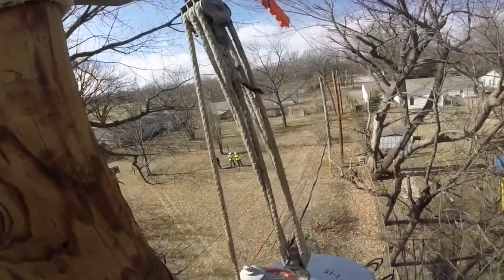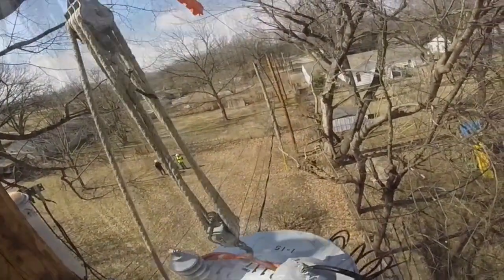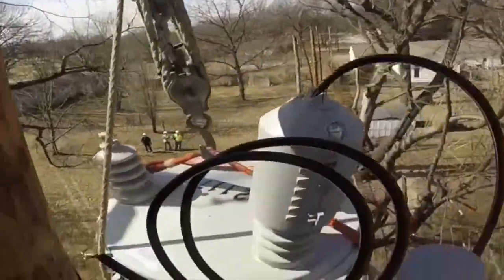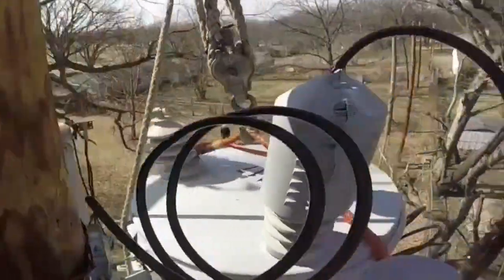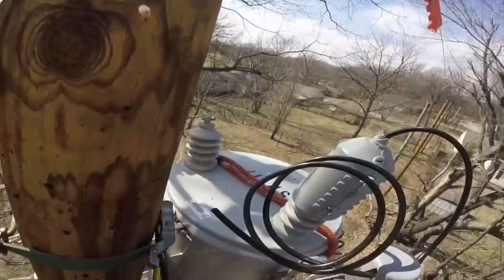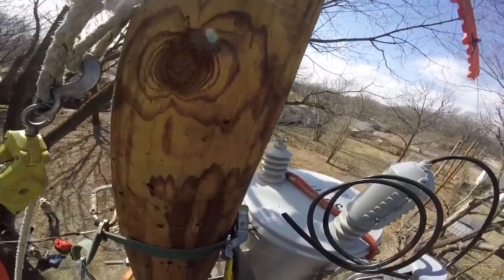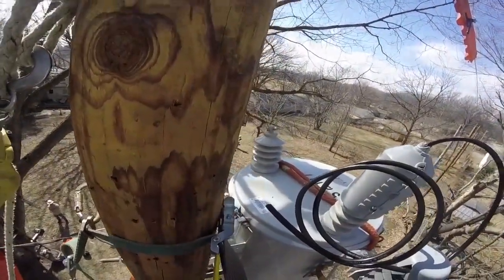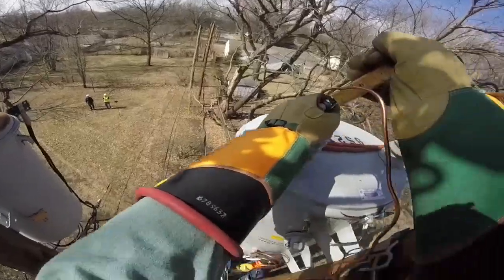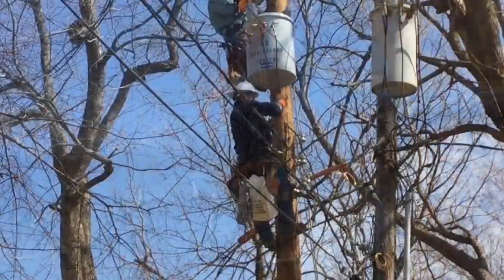Now we go back to Chester's point of view and you can see the transformer coming up — you see that three-rope assembly clearly. The transformer comes up, he grabs it by hand and sets it into place. The pole gin and ropes are removed, it's secured with a metal bracket, and he swings around to the other side of the pole to tighten the connections of the new transformer high above the street.